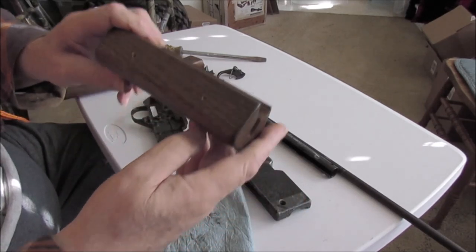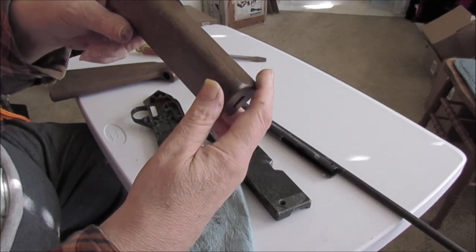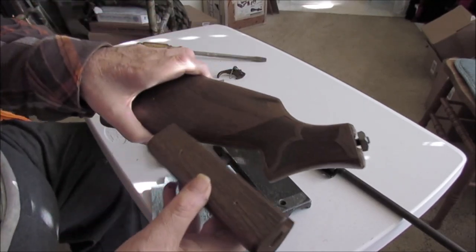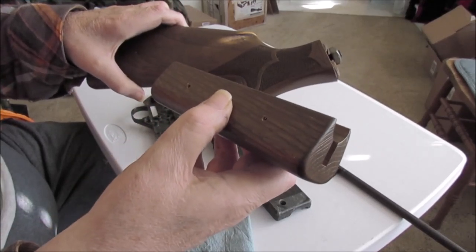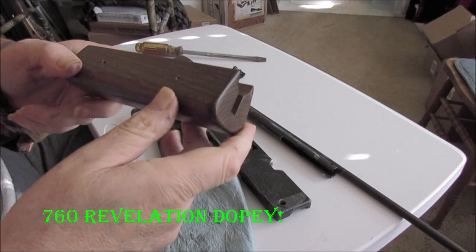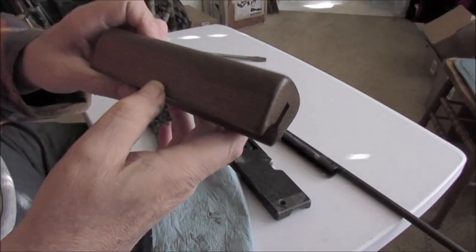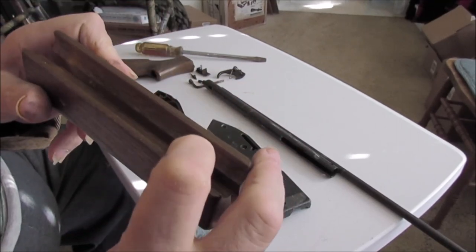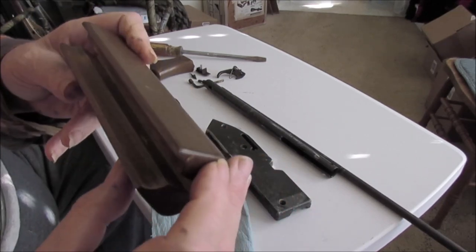It's medium walnut, and that's elm — you can tell it's elm wood because of the grain structure. How about that? And even on the 761XLs I have — I've got two on the rack over there — these holes for the pins that go through here into the pump arm don't go all the way through, on any of them. Never did. There are little holes where it goes into this part, but I'm going to see if I've got a drill bit long enough to drill all the way through, because once you put the pins in, you've got no hole on the other side to stick a roll pin punch through and pound the pin back out again. So I'm going to fix that.